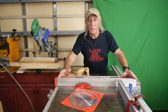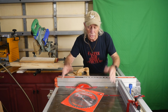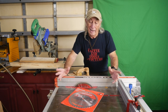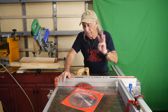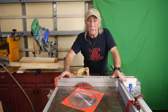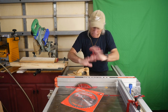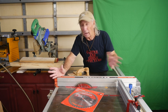When you buy a new or used table saw, the first thing you should consider after getting it home is what sort of blade you need. Generally I find most people buy three blades: a low tooth count, a middle-of-the-road tooth count, and a high tooth count. I usually like to go somewhere around 40, 60, and 80 for the different cuts needed across the different projects I get into.